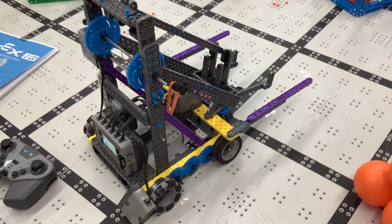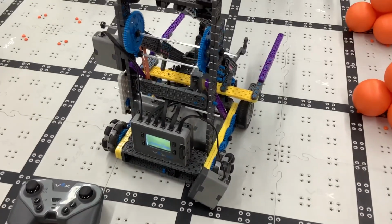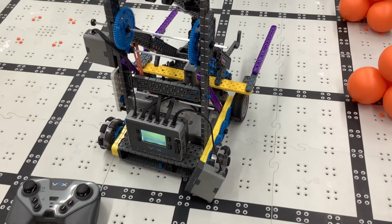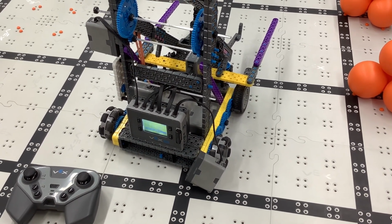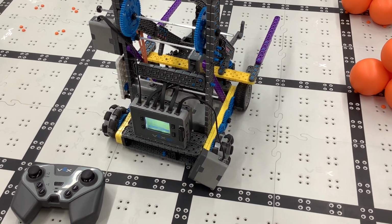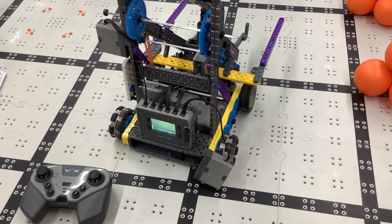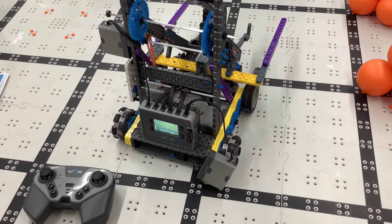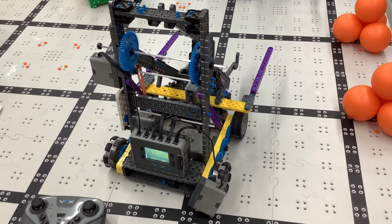And the reverse applies also. We saw some people using two motors that used extra gear reduction for extra power, but you didn't really need that. So they had an arm that was super slow because they had extra gear reduction, but they had two motors. So they didn't need the extra gear reduction, or they didn't need the other motor. One of those two things was a problem.